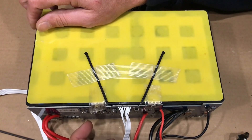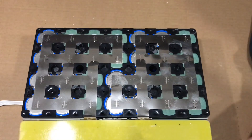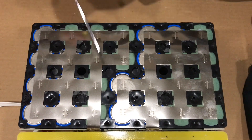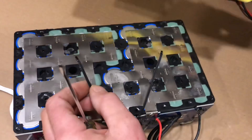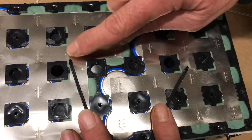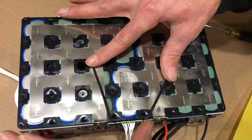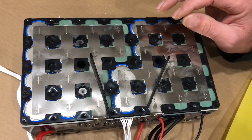Now on to the top side of the battery. Remember the bottom had the bus bars arranged one way — let's get this top cover off. Now you can see how the bus bars and positives and negatives all correlate — how they joined them in the cell pack design to get the watt hours of capacity and the desired voltage. It's a completely different layout than the bottom. These little black wires are the temperature sensors — they tried to get them close to the center of the cell pack. These are the high temp cutouts. This does not have low temp protection — only high temp protection. If a cell shorts or gets hot, the temperature sensor goes to the BMS, and the BMS cuts power on the output of these batteries for safety.